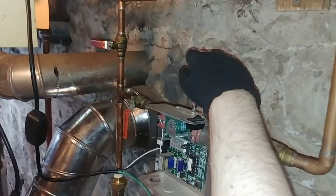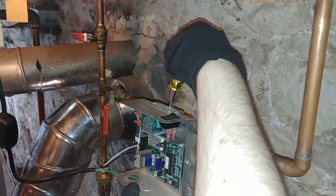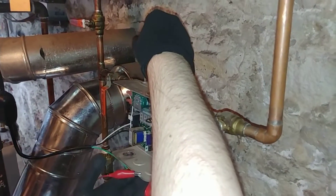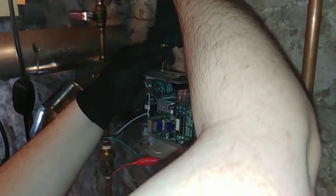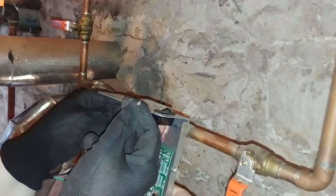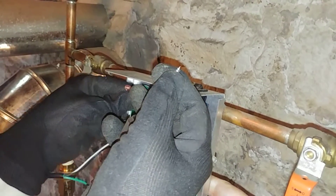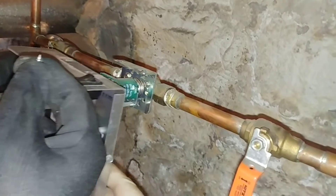He's using a Phillips to take out those Phillips head sheet metal screws, which holds the VXT electronics to the bracket. Set those aside where they can't be lost — we always try to have extras. There we go. Go ahead and pull off the tabs holding the power. Wiggle them off. And then two. The electronics can be set aside.